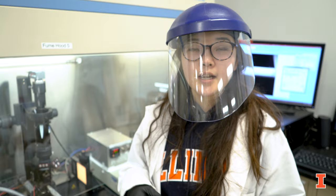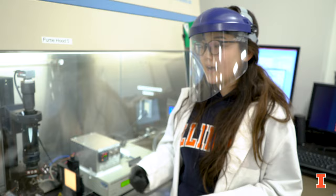The first thing we need to do after cleaning the substrate ultrasonically as well as depositing a zinc oxide layer using spin coating, is to deposit the active photoactive layer using a 2D printer, as you can see here.